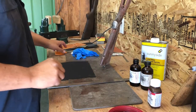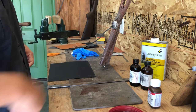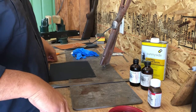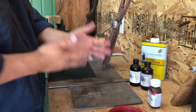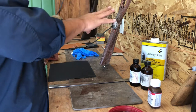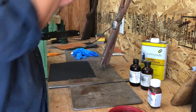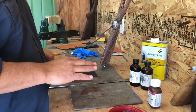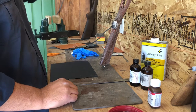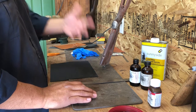We just did stock finishing on the 9.3x62 — I think that was part five — so this is the follow-up, part six. I'm four to five coats into this stock right now. After I put my three coats of sealer, I put a fourth coat on, sanded it, put a fifth coat on, and put it back in my hot box. That's what I was talking about — the hot box really helps me speed the process up a bit.